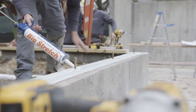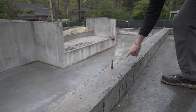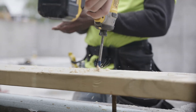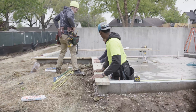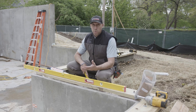We do that for a couple of reasons. You can see here we have a top of wall condition that is generally flat, but not perfect — we have some raised areas and imperfections that would make it hard to trust as a flat-to-flat mating surface. So we can't just put down that foam seal and expect it to keep the air from moving through that connection. What we're doing is applying the sealant below and then above the foam gasket to really supercharge it and make it adhere to both the concrete and to the bottom of the mud sill. One of the things that we like about this strategy is that, like most of the strategies we utilize, it's easily inspectable — being able to see continuity of one material to the next gives us ready assurance that we've done our job effectively.